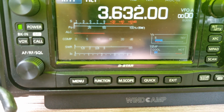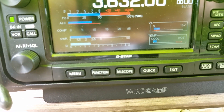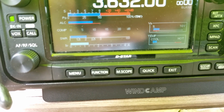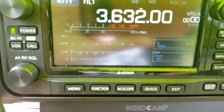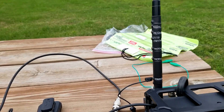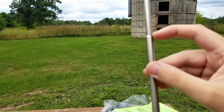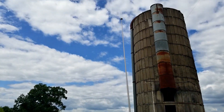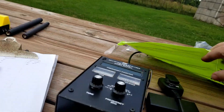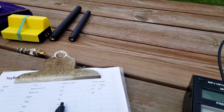We're at the same frequency on the radio as we were on the antenna analyzer, and you can see it's not terribly happy. The closer I get into the field of the antenna, the happier it gets — so I'm still not convinced about this on 80 meters, but I'm going to write down these measurements and keep moving forward. For the Toy Box on 40 meters, I need 38 inches on the whip — first three sections compressed, then about four inches on the next one, rest fully extended.